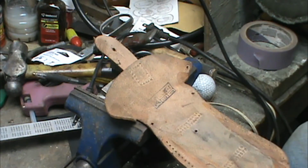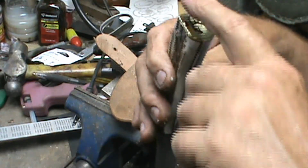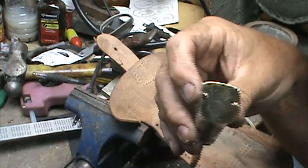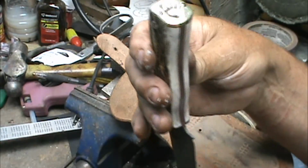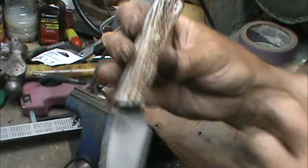So now, this almost closes the book on this knife. Almost. Now, that shined up there, that polished around the edges, a little bit of satin in the middle, make them pop, make them draw your eye to it. And there's black epoxy, I made the epoxy black when I deeply etched that. Now, it's got silicone bronze pins to hold it on there. So, there it is. Dog pile.